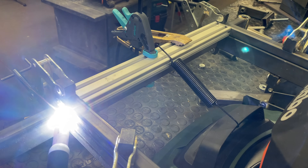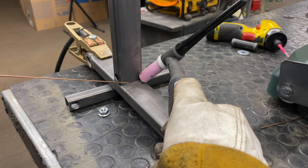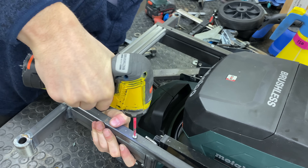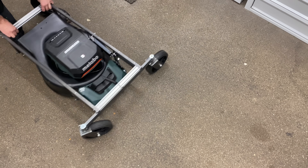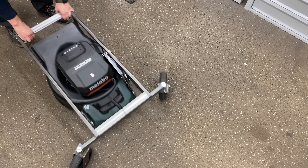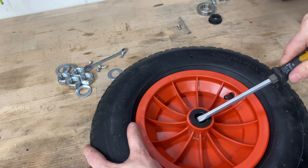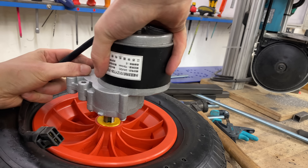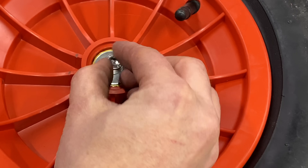I only tacked the pieces together while they were attached to get the perfect geometry and then I welded the joints completely. Remember I need to be able to take the spreader bar off otherwise I cannot disassemble the whole frame. So now we have a nice and smooth motion and I think this will work out great. Now that the front part is sorted it's time to work on the back wheels. I've removed the inside bearings — we don't need them — and I printed these little adapters that go on top of our motors. The nice thing is I don't have to machine any steel, it's just 3D printed.